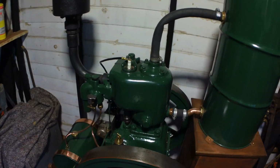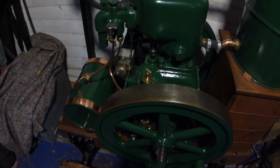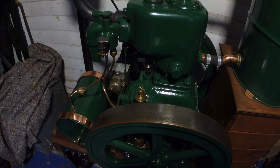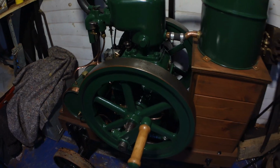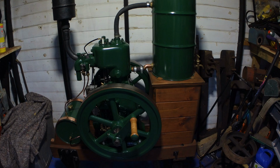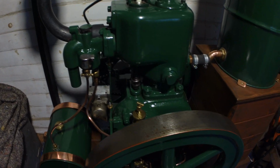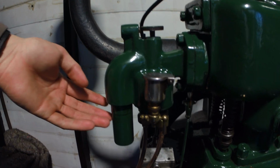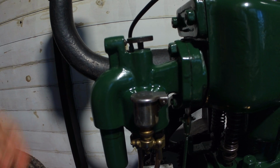Hi guys, so over Saturday me and Nathan went up to Peterborough to pick up this 1921-1922 Lister H Bruston engine. The Bruston stands for a lighting plant engine. As you may notice if you know your Lister H2R range, on the Bruston engines they had a vertical carburettor but faced down with a little fuel chamber instead of the choke wheel.